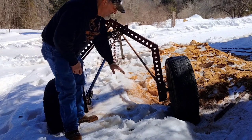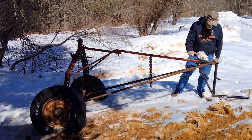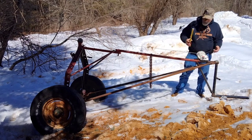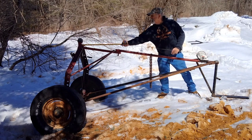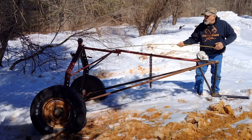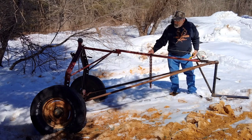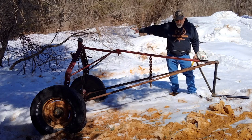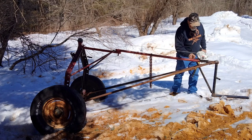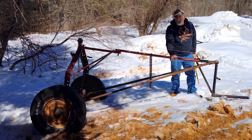The winch is just a cheap boat winch from Harbor Freight mounted on the backbone of the log arch. The backbone is 92 inches long. We can get a 12-foot log on this without a problem and could go longer by letting the front of the log rest up in the arch, but the longer the log the more weight it takes off the tongue, which could present a problem. The backbone is made out of schedule 80 pipe — the heaviest pipe I could use — and we did the same for Tim's, which works out really well.